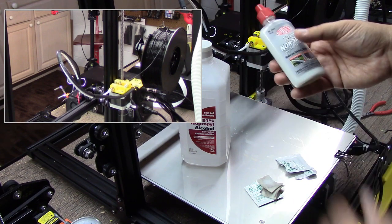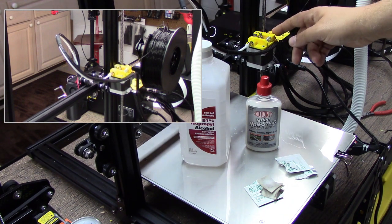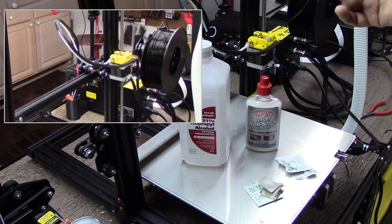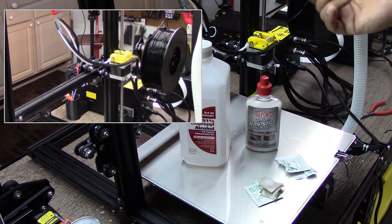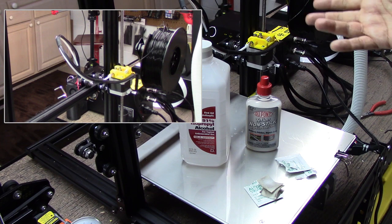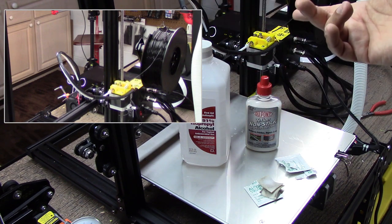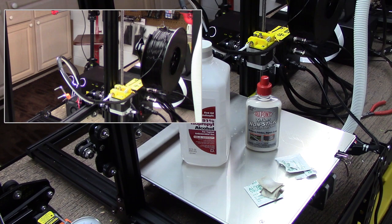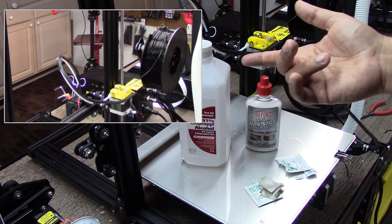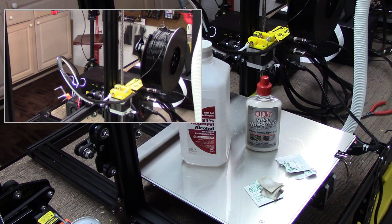This has worked out well. After you clean up the rod, what I did — as you can see in the video — is just run a couple of drops on down. It doesn't take a whole lot. Then I run the machine up and down. The CR10 doesn't really have a manual movement for the Z-axis, so I wrote a G-code program — I'll have the link down below so you can download and install it. It simply exercises the Z-axis up and down several times, distributing the film for an even coating all the way up and down the rod. Then you're basically done.